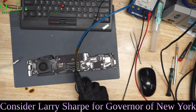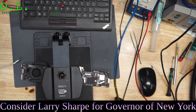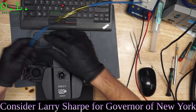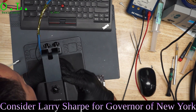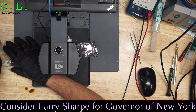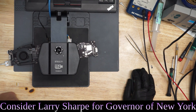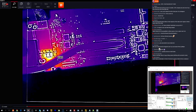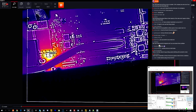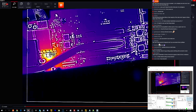It's time to plug in the thermal camera. Let's see what's getting hot on my board. So it looks like we have a 39 Celsius board, 46 Celsius, 80 Celsius, and then when we get over to here we have 126 Celsius. That's 127 Celsius — that's damn near soldering itself right off of the board.